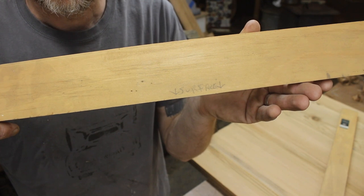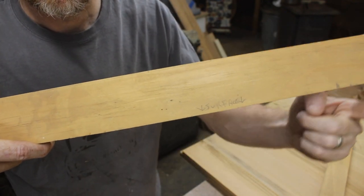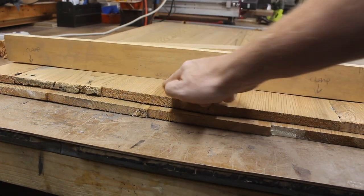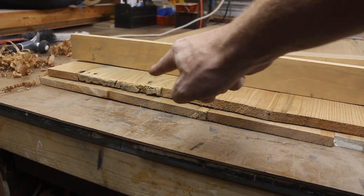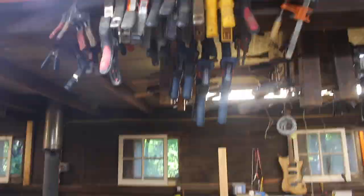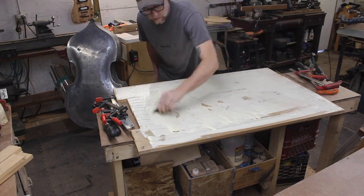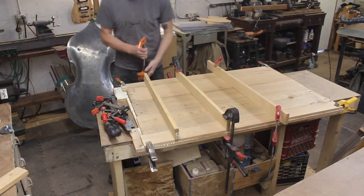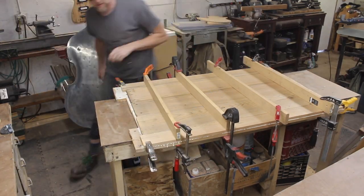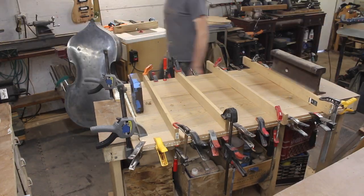Here's a little trick for gluing together panels like that: you'll notice the piece of wood bows out in the center — I had planed the edges down shorter. So when I apply clamps to either side, the pressure actually gets pushed more in the center than the edges, and that helps reach places where you might not have clamps long enough. A lot of glue, clamps around the edge, and center clamps to push it down there. It came out alright — there were some gaps when I started carving, but for the most part it was pretty good.